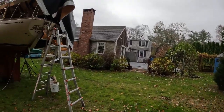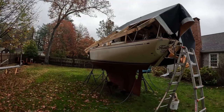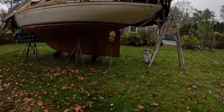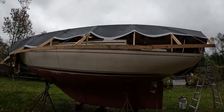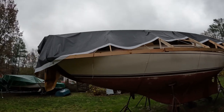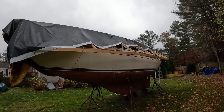We'll try this again because I just filmed everything without having the microphone turned on. We are dealing with the remnants of Nicole right now, and you can see what that did to my cover. The wind rattling and looping around managed to rotate the cover a little bit on the boat. Also, two lines came untied. I was concerned the grommets pulled out, but they didn't. I have to think about the knots I'm using — maybe a couple of half hitches is not the best knot, and I should go back to tying bowlines or some other type of running hitch to hold the cover down.